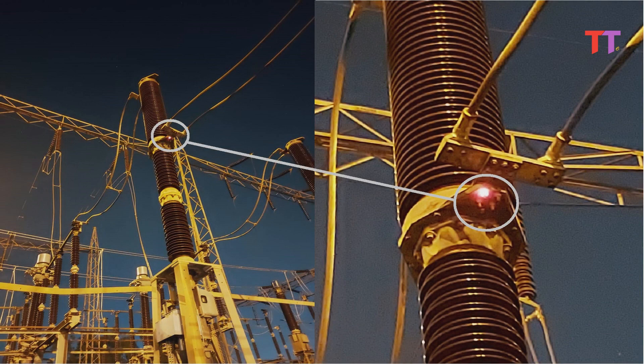This picture is taken at night. We can see a hotspot on the circuit breaker bottom palm. Among these four nutbolts, one nutbolt is glowing — that's why it is visible at night without an infrared camera. But since it is literally glowing, its temperature must be very high and it can break at any time. This is not a desirable condition. Hence, to avoid such a situation, it is necessary to do thermal imaging regularly.